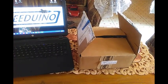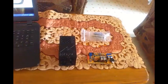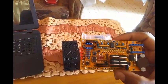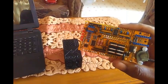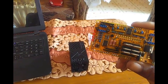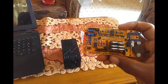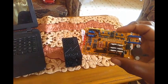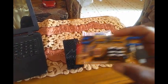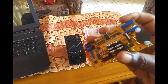So I'll make a quick video to show you guys what to expect and what I got in this box. This is the actual PCB — this is the ECU. This one is called the NO2C. That basically means no overhang, two channel. No overhang pretty much means the board is the same size as the Arduino which it plugs into, so it's a cleaner look. Two channels means you get two fuel and two spark channels.